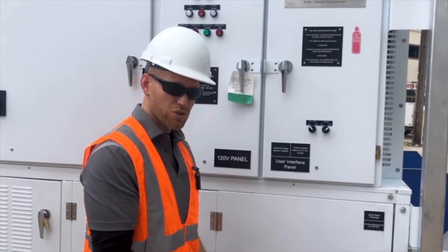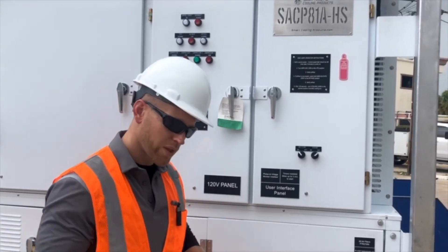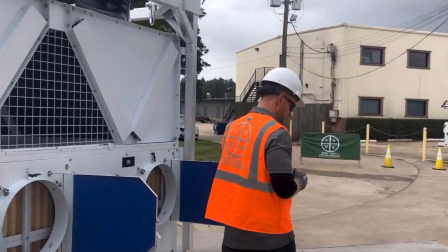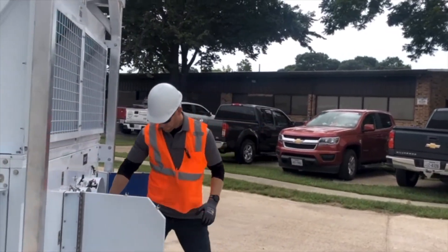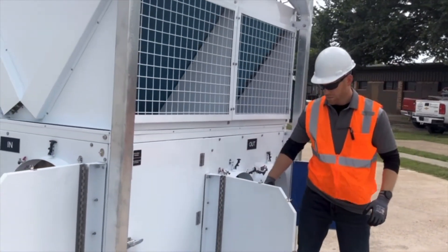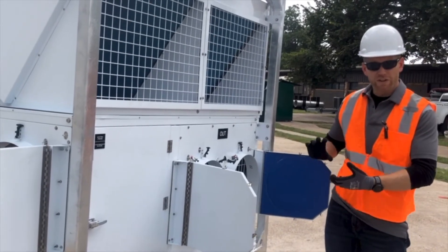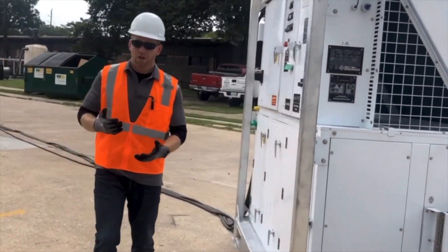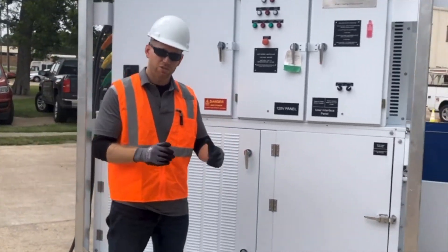You'll see there's a short startup delay and then the blower starts to ramp up — I can hear it now. Come with me to the outlet airflow side of the machine. I'm at a little bit less than 50% on the blower speed pot. After you have established airflow, allow the machine to run freely without turning your compressors on for at least three minutes. This allows you to establish airflow through the job site.